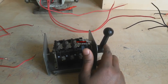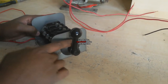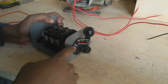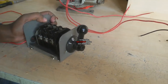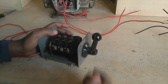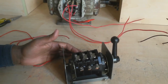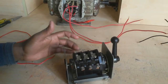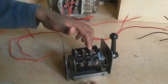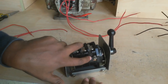This handle is now in stop position. 0 is stop position, 1 is on position and the other is also on position. So there are two on positions and one off position. When this switch is in the on position, this contact connects here, this contact connects here, and this contact connects here. In this other on position, these contacts are not connected.